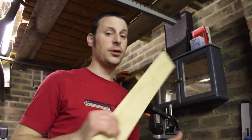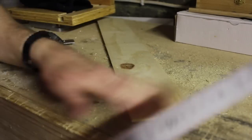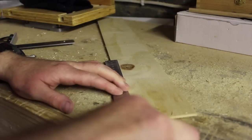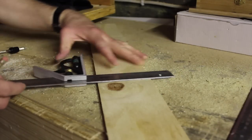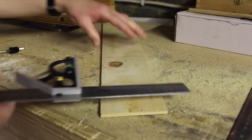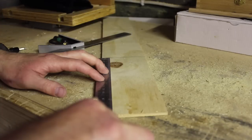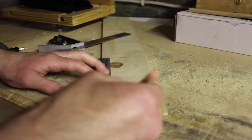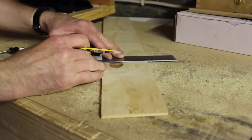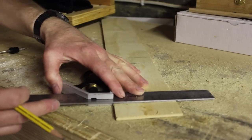The reason why I'm going to be making the template is because I thought it would come in handy for future projects, especially if I make a few more of these little jigs. What I want to do with this template is measure out 20cm, which is the length of the base plate of the block, and then measure in about 3cm each side to give me a rough idea of how big I want my handle to be. This should give me a guide to work with.